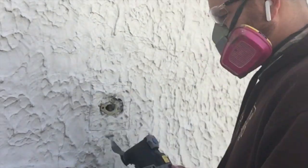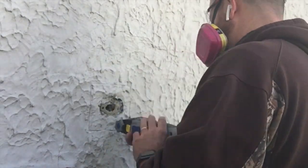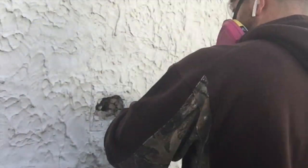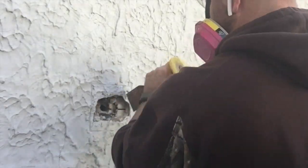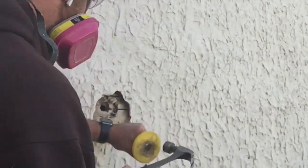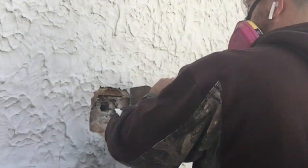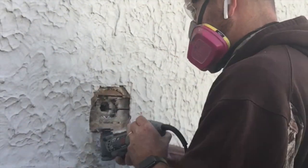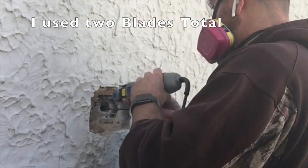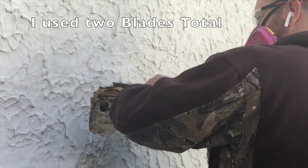After that, I got out my brand new oscillating tool by Dremel — one I picked up for this job in particular — and I went ahead and cut and scratched out the side of the stucco opening. Then I had to chisel the stucco out a little bit at a time. I couldn't take full chunks out. I went back and forth between chiseling and using the Dremel until I was confident that the wood had a pretty good shot of actually fitting in there.